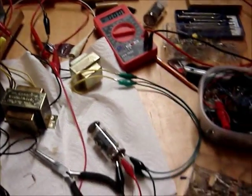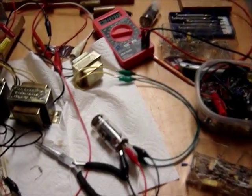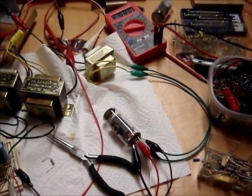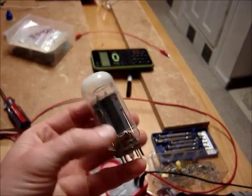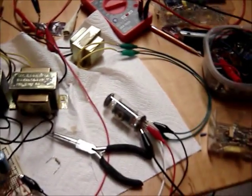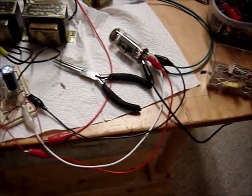This giant mess here is a rigged-up tube tester. I bought this amplifier off Craigslist and it doesn't work right — I got it for 15 bucks. The case and everything is in good shape, but it needs capacitors replaced. One of the tubes was cracked around the bottom so it has to be replaced. Unfortunately it's an expensive output tube. It's a push-pull amplifier so it has two tubes — the 7868-type output tubes, which are expensive, like $35 a piece, even on eBay.